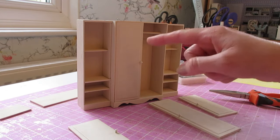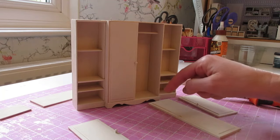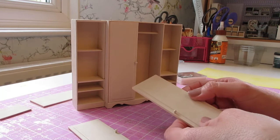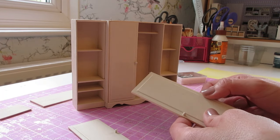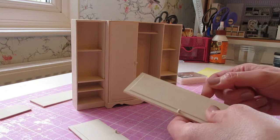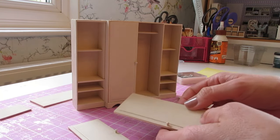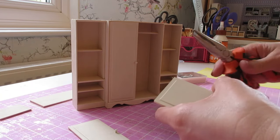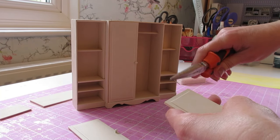I'm actually going to fit the second door before I push that pin in, because if we have any problems — if we need to sand a little bit off the center of the doors — we can do that to both doors to keep things even. The thing is, once you've pushed that pin in you can't get it out again without causing damage to your wardrobe, so always leave that until you're really sure you're happy with the doors.